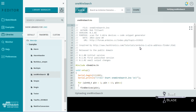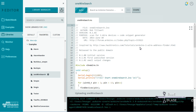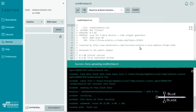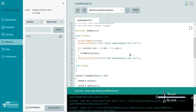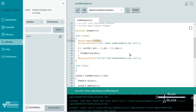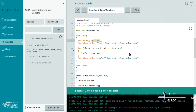This sketch will find the sensor's address, which we'll need for later. Upload the example sketch to your Arduino and then open the serial monitor by clicking on the link to the left. We get gobbledygook at first — this is because the sketch sets the serial baud to 115,200, so we need to match that in the serial monitor. Once that's done, the data looks much better. Now we see the address found for the new sensor we just wired. Copy that and save it for later.